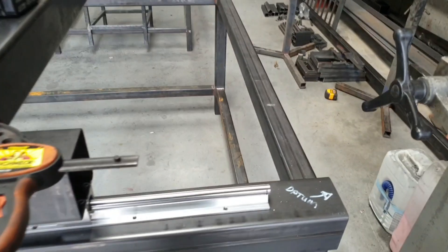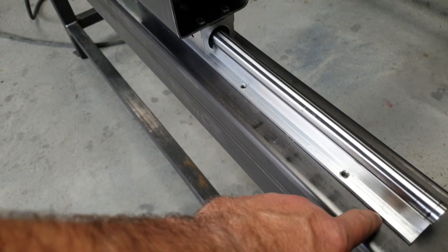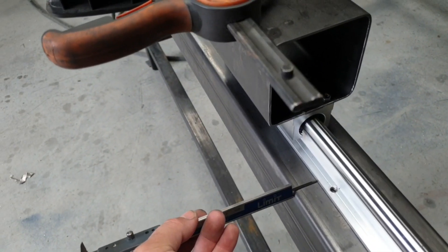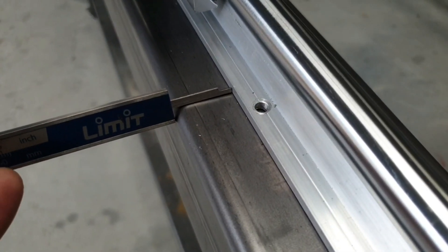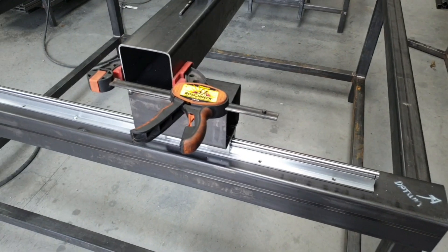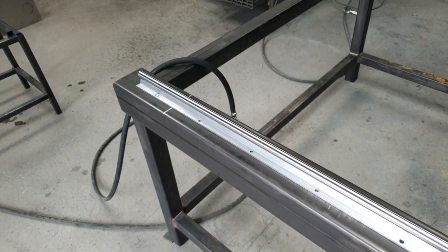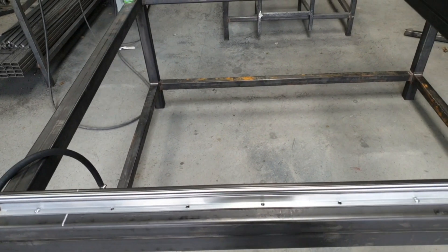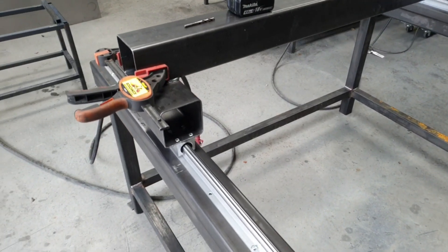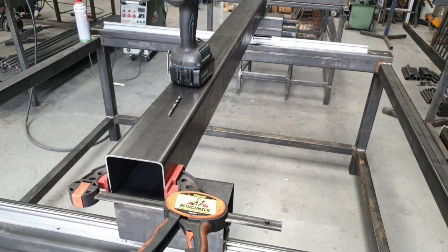The secret really is to choose your datum point that you're going to work from. Set your rail distance exactly — I use a vernier, measure from there to there. Put the screws in, give it a little tippy tap to make sure the rail stays dead parallel to that piece of box, which is your datum piece of box section — the part of the frame that you're going to make every measurement from. This is pretty much as far as I've got, and it just glides, absolutely glides. It's just easy peasy — no binding, no sticking or anything like that.